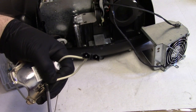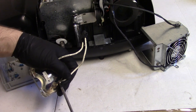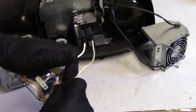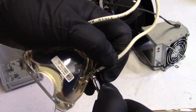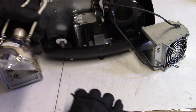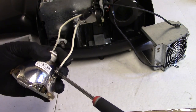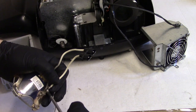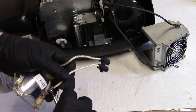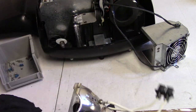I'm going to snug these wires down. That wire was way too loose. I wonder if that was contributing to their flickering, having a loose wire. I'm just going to flip that connector over. You want to have the flat side of the wire against the connector like that. Yeah, that feels much better. Oh, this one's backwards too. Well, it would still work. I don't think that was really a big problem, but I like to do it this way so that you have very good, flush connections.